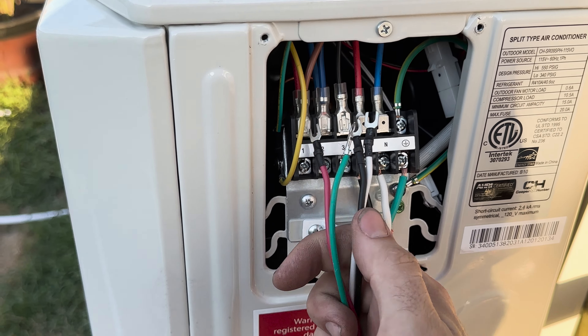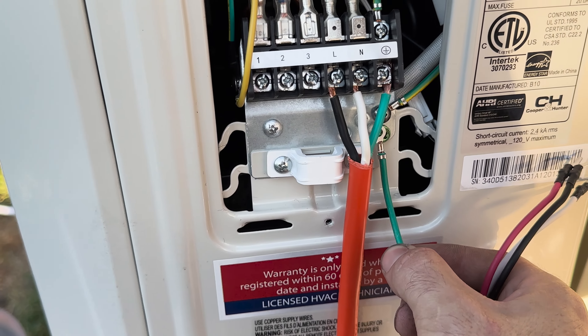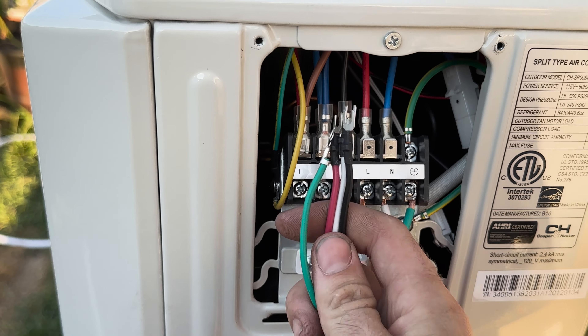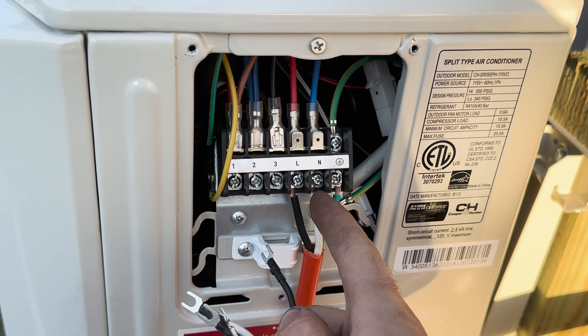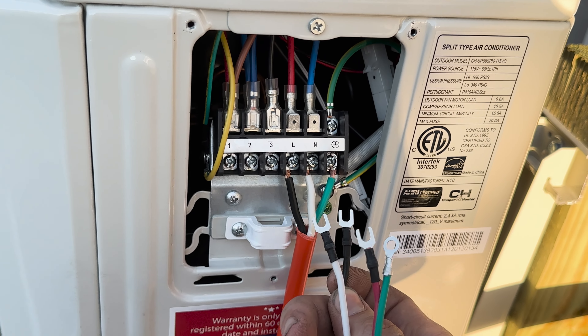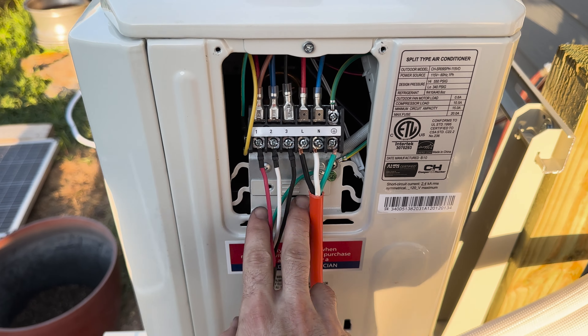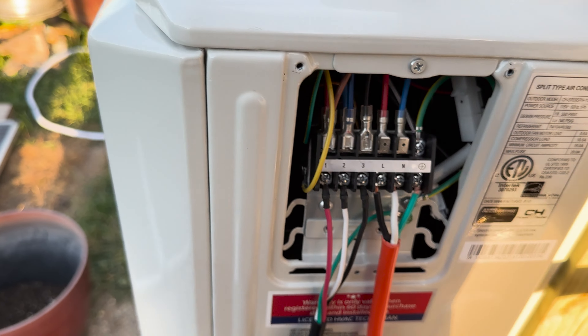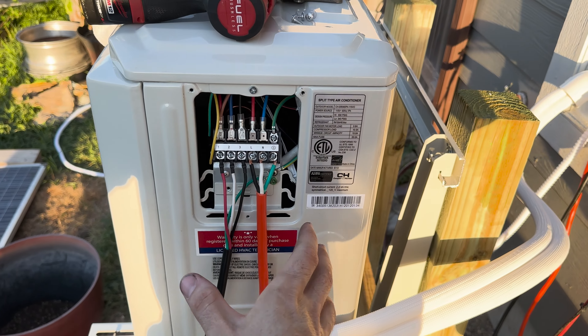We're going to hook these up — I'm going to reference the picture I took of the indoor unit wiring. The ground goes right there, and then I'll reference the picture for conductors one, two, and three and get those hooked up. These are the type of spade connectors you need to crimp on your electrical connectors in order for them to fit in the terminal block perfectly. I'm going to go back and add those later once they arrive. This is what we're left with — that's really all there is to it. Now I'm going to put the anti-fatigue strain relief on there, put the cover box back on, and the wiring is complete. All you have to do is give this thing 120 volts and it will work.